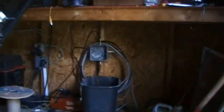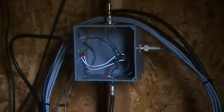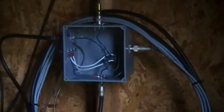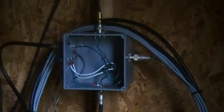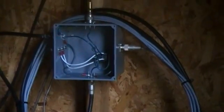I'll show you inside — if I've got enough light. Okay, this is the phase box I put together. Inside the phase box there's a 12-volt relay. It's got four coaxes going in: one goes out to a 75-ohm quarter-wave line on 40, then 50-ohm coax leads to my original antenna, and it's got a phase line. I'm going to replace all that coax — it's curled up there — with the same kind. I just didn't quite have enough and wanted to put this together and do a test first.